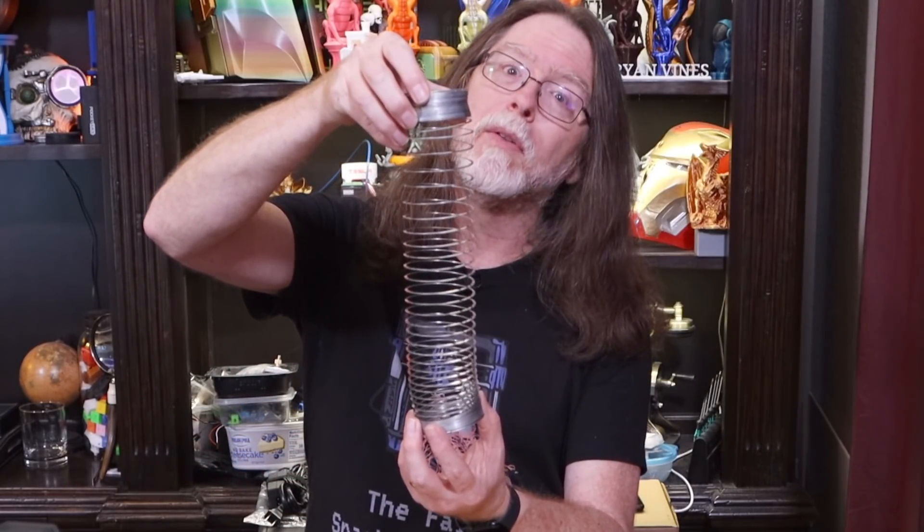The solution is what I call fake vase mode, and here's why I call it that. When you slice a model using spiral vase mode, or spiralize outer contour, your slicer makes some intelligent decisions for you. First, it ignores the interior of the model — that's like having 0% infill. Second, while it keeps your bottom layer count the same, it doesn't print any top layers at all, so that's like setting your number of top layers to 0. Third, it prints only the outer wall — that's like setting your wall or perimeter count to 1. Fourth, the slicer tells the printer to print that outer wall as a spiral, starting from the last of your bottom layers and slowly raising the z-axis up, so that every time the nozzle has made a pass around the model, it's moved up by whatever your layer thickness is. I can't fake that fourth thing — fake vase mode happens one layer at a time — but I can fake the first three just by adjusting slicer settings.